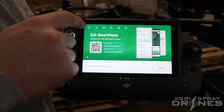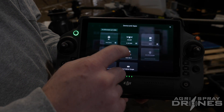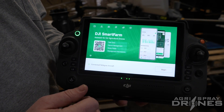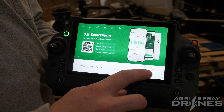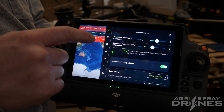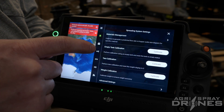I should note that we are on the latest firmware as of right now — 712 on the remote and 400 on the drone. Different firmwares do have slightly different calibration styles or menus. To calibrate, go to Begin, then Settings on the top right, then Spreader Settings. We're just going to start at the top of the list where it says Calibrate.